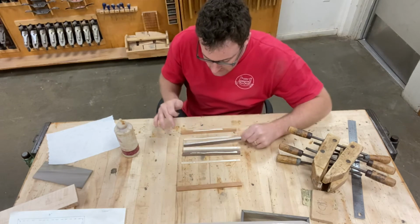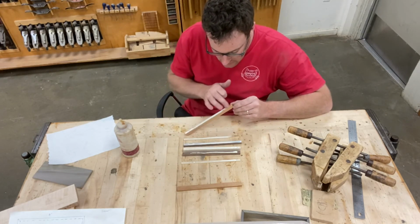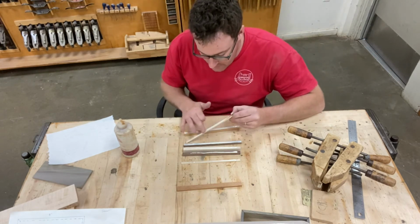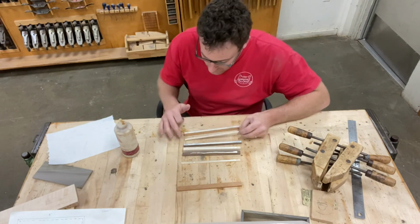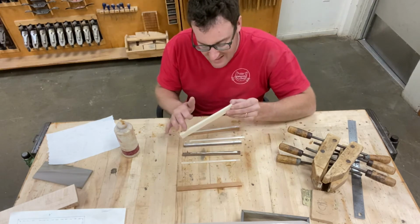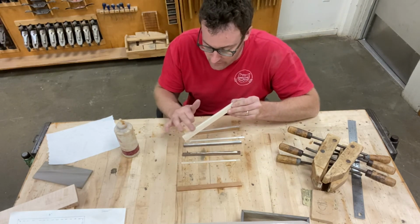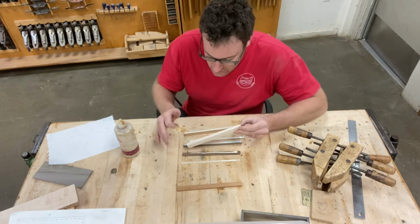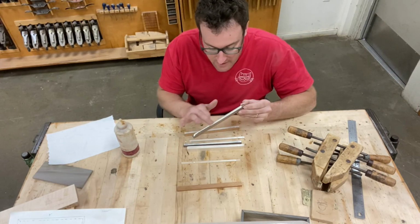It's real important to not make a giant mess out of this. But if you do, you gotta clean it up. Water cleans up glue before it's hardened. After it's hardened, water doesn't clean up glue. The glue that we use here is waterproof. It's Titebond 3, so once it dries, it's waterproof. It won't come out of your clothes if you get it on your clothes. If you let it dry, you gotta wash that out immediately.